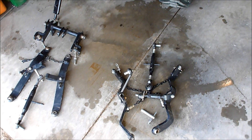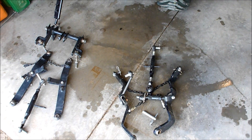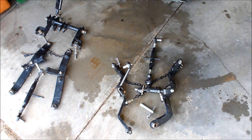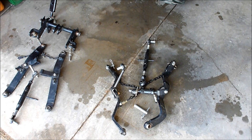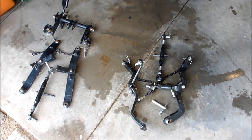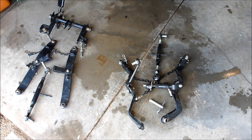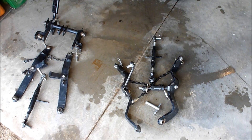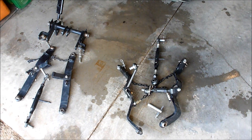The Category 1 Limited means limited lift height. You only have at most a fully ballasted 2,000-pound machine — like the X748 with all kinds of ballast. You're just not going to get the lift height, nor can you attach full-size Category 1 implements in the back. There are lots of videos of guys that do it, but you're going to run out of weight or traction on the machine long before you run out of horsepower in any given case.